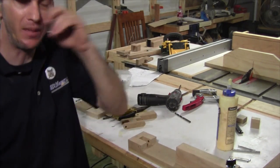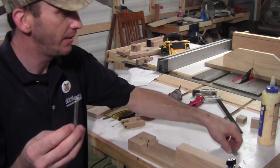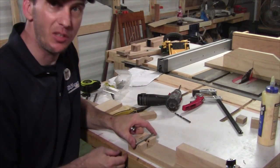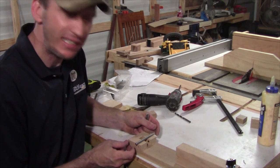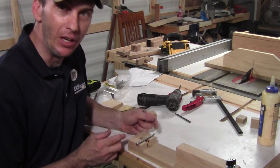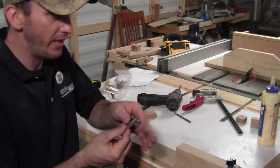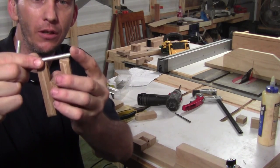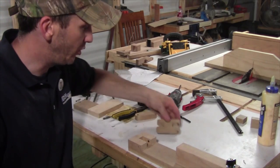Out of my quarter-inch rod I cut three pins. The first pin is a little bit longer — basically I span the whole width. I made it about 3 and 3/8 inches long so I have a little bit of overhang on each side. The other two pins are a little bit longer than the width of our link, for both sides.